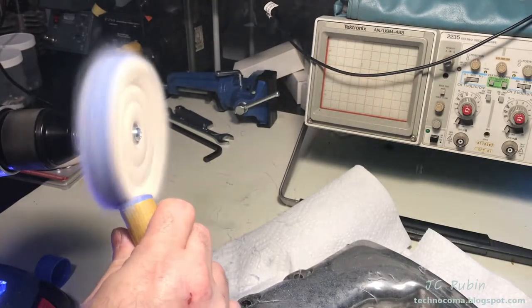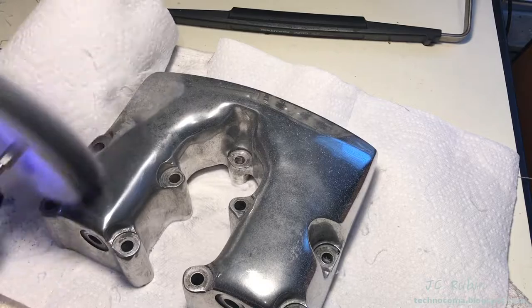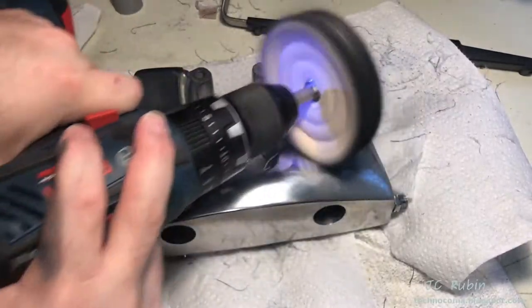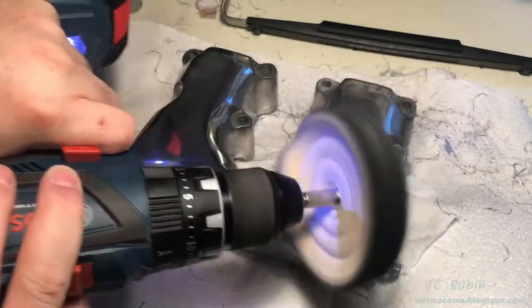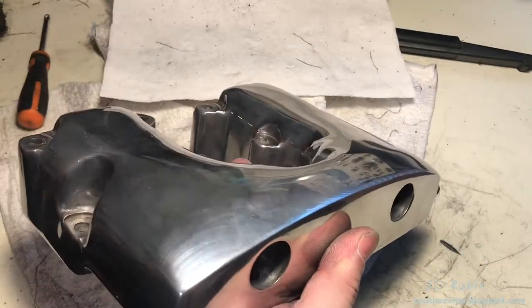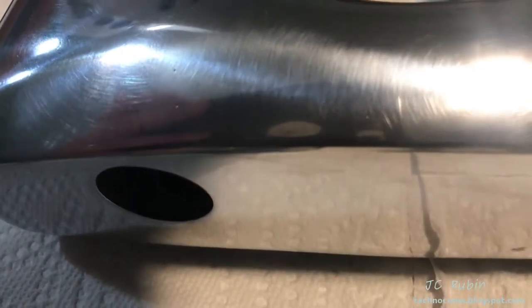Using a buffing wheel on the drill, I'm testing out the blue compound first — it's smoother than the gray. I wanted to be sure before going with gray first since it's coarser. My buffing wheel is actually too small — it's a grinding wheel — so I just continued this way. The gray cuts a bit deeper and leaves a swirl, so I follow up with the blue to take the swirl out. Working with the gray first cleans it up really nice and quick. These are shine boxes, but you see that swirl, which is why we revisit with the blue thereafter for a nice reflection. I'm not going to use the paste until it's mounted on the engine for that really nice mirror finish. I take the other one and do the exact same thing.